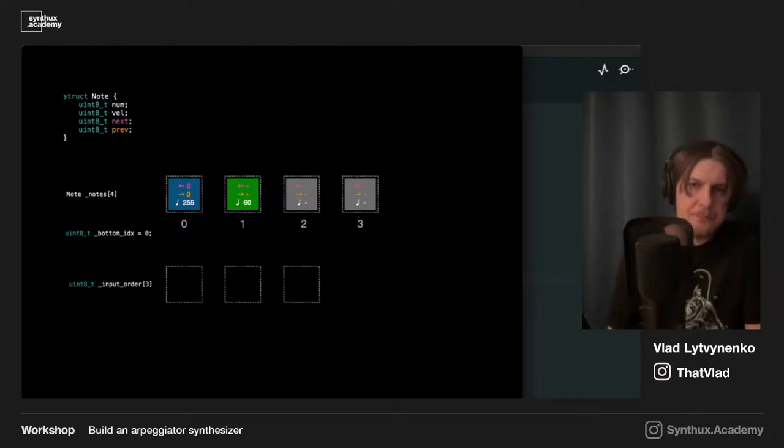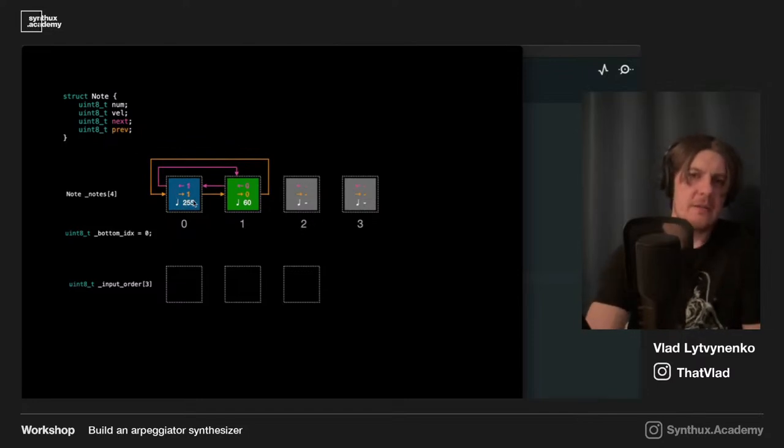And then the second phase happens. It looks through this list of nodes for a node that is higher than the inserted one. So something that is higher than 60. And in this case, 255 is higher than 60. So the algorithm will stop there, and it will just link them together. So at this point, the sentinel node looks to element one, element one looks to the sentinel, and in the backward direction it is the same. They just look at each other.